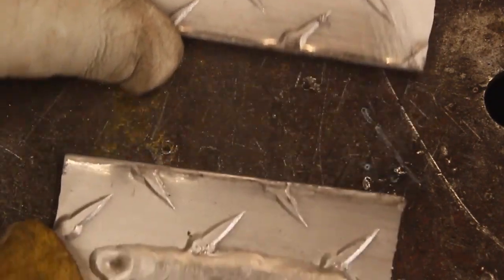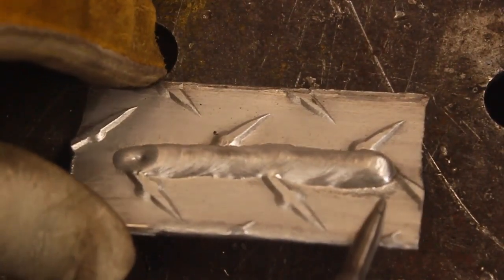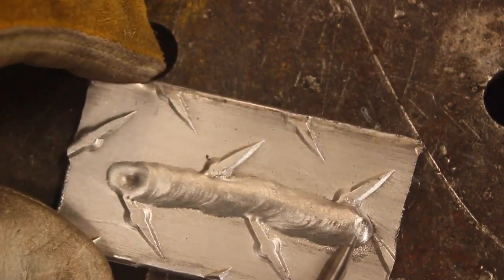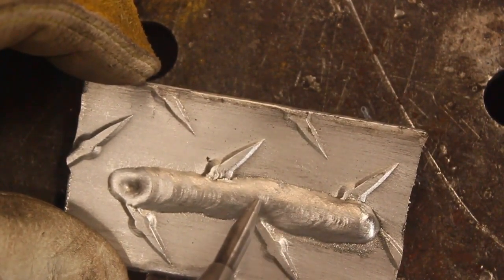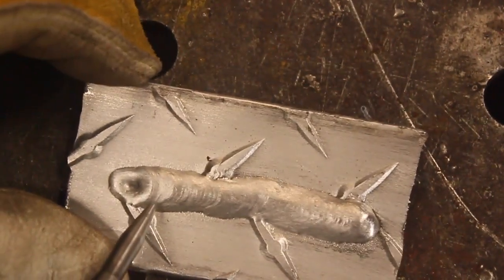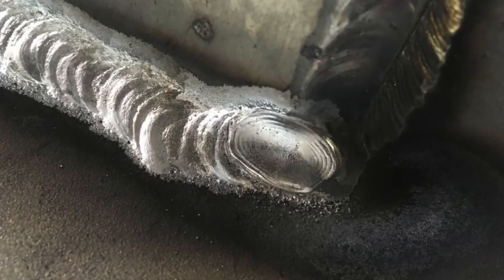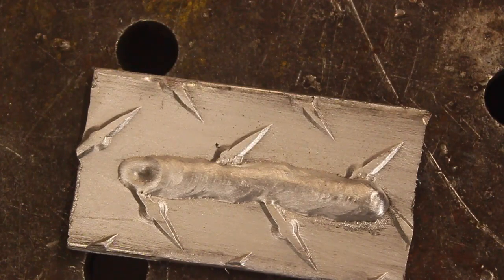So now with the advanced machine there is a hot start which binds the toe lines really nice, and it starts out 35% over the suggested setting, and then it goes down to the suggested setting. Here we used a 2.5 second crater fill, which makes the crater a lot less. With another second it probably would have been gone all the way. So now let's take a look at the machine and see how we do this.